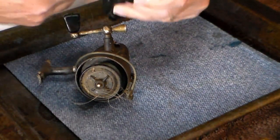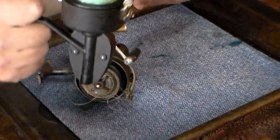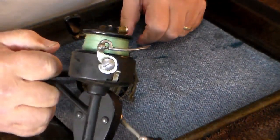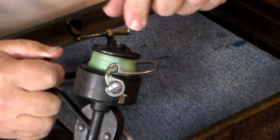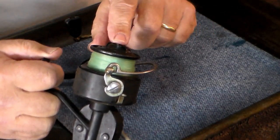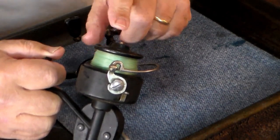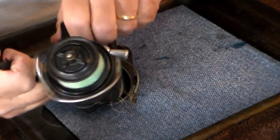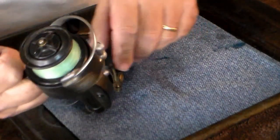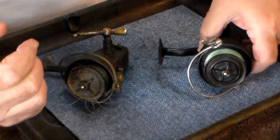On the first one, if you look at this - when you bring it all the way up, look at the spool. See how it's much thicker at the bottom than it is at the top? That means the spool is riding too high up on the shaft. So what we're going to have to do is figure out why it's riding high and correct that. We're going to pull it all apart. It works fine, it looks really nice, it does a good job, but that's what we're going to try to do.